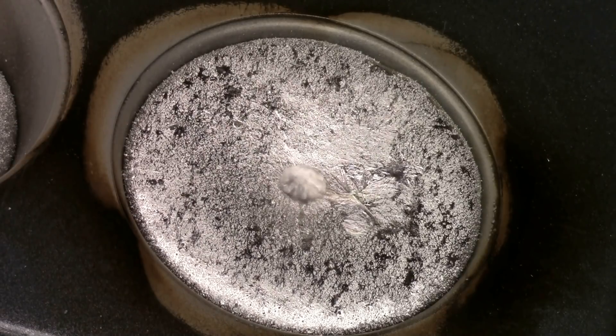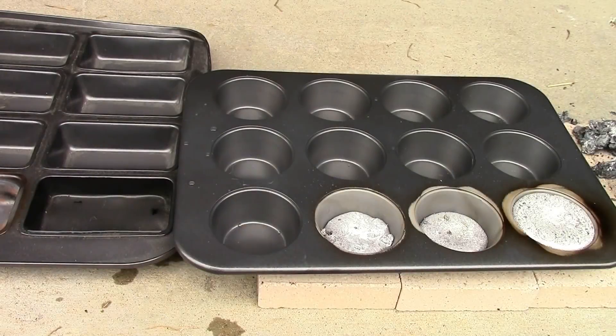The Leidenfrost effect is when a liquid is dripped on a very hot surface — it evaporates immediately and makes a little cushion of gas underneath the droplet that protects it from further evaporation. So you get a droplet hovering on a cushion of water vapor, which slows down the evaporation so it doesn't immediately puff into steam. Now let's demold these while they're still hot, and I'm going to use my old mold as a source of water so we can cool them off quickly.